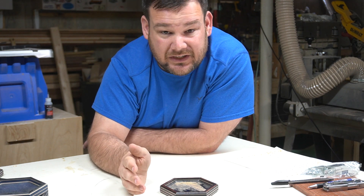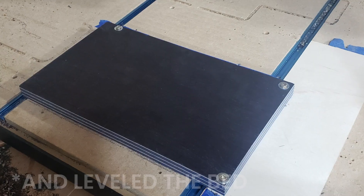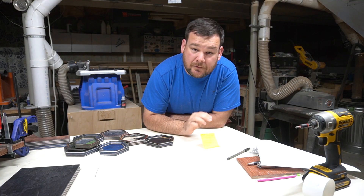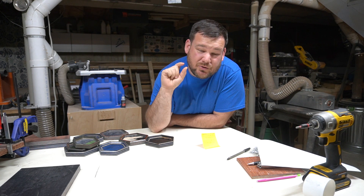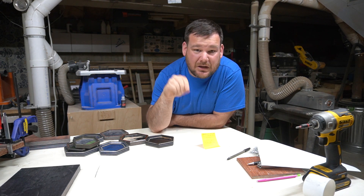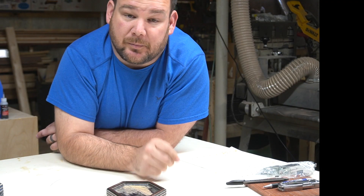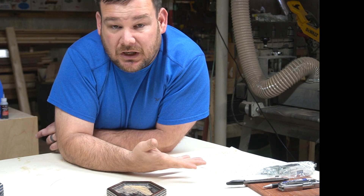If you see the different colors in the bottom, that's because either the bed of my CNC machine or my Z-axis or something is slightly out of square. We're dealing with sixteenths of an inch here, so you really see weaknesses in your machines that you usually would not be able to tell. I fiddled around with it and tried to change some machining techniques, and it just wasn't worth the effort. What I learned was that I had to machine down to a point where there are at least two layers of the same color. This doubles my room for error from a sixteenth inch to an eighth inch. One reason this is important when developing products is you want consistency.